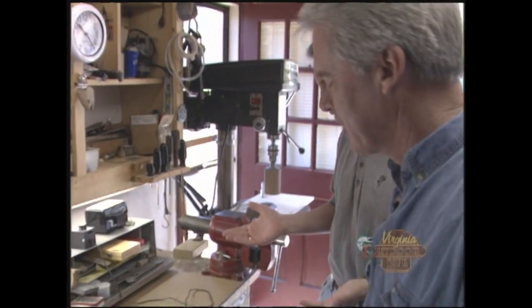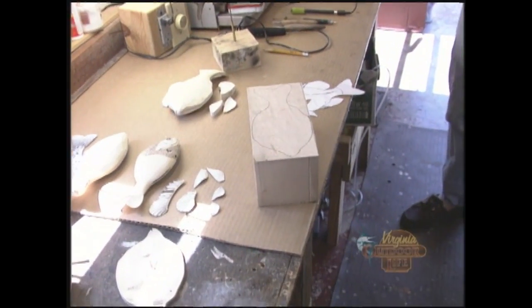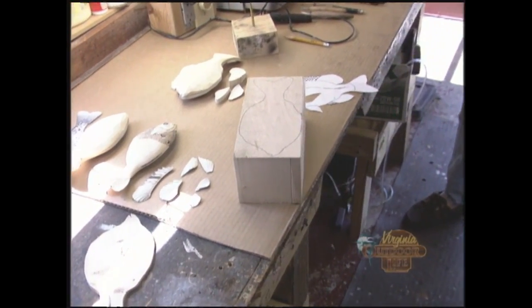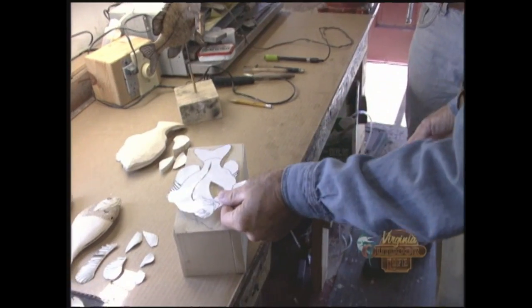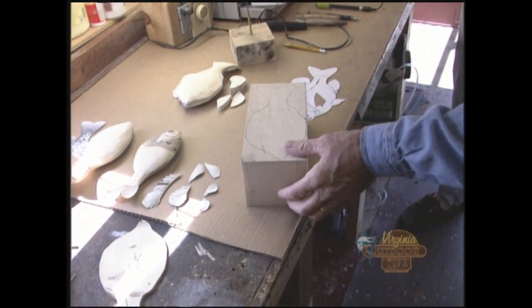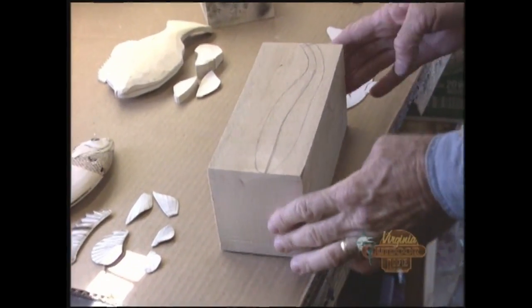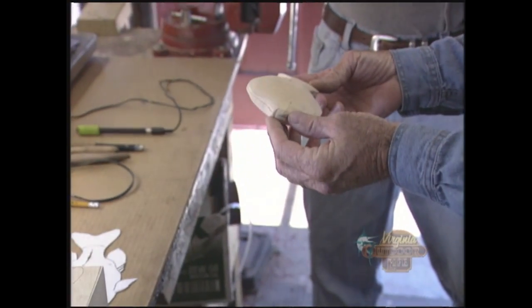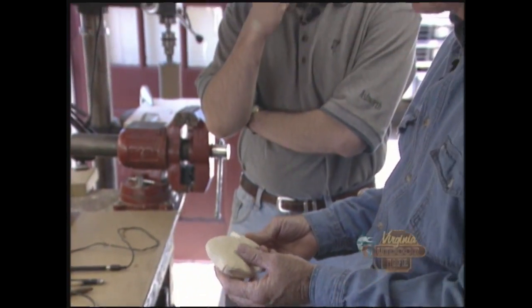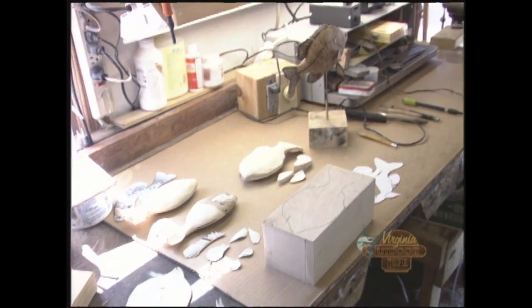When you first started carving, how do you start? It begins with a large block of tupelo, which I use for carving — the tupelo comes from the swamps in North Carolina; it's the old black gum tree, and they use the base of the tree. I design a pattern, the pattern is put onto the tupelo and traced out, then it's roughed out on a bandsaw. I also have a top design of the general shape of the fish I want. It's cut out on the bandsaw, which leaves me a rough pattern, then I go to my sander and remove a lot of the excess material. Then I take my knives or chisels and get the final shape. How long does it take from the block stage to right here? That's probably two or three hours — so that's the easy part.